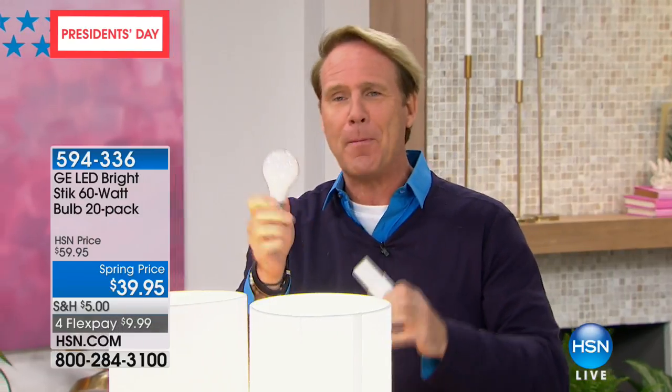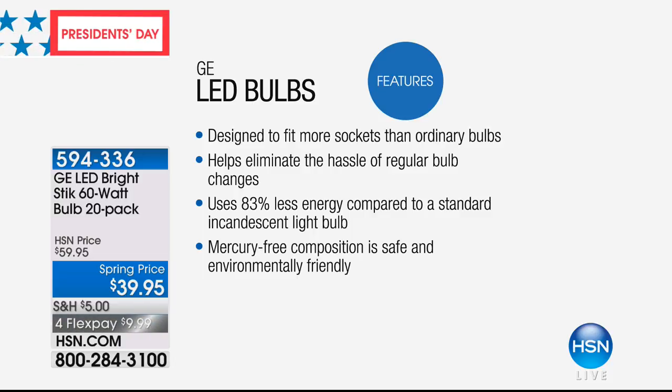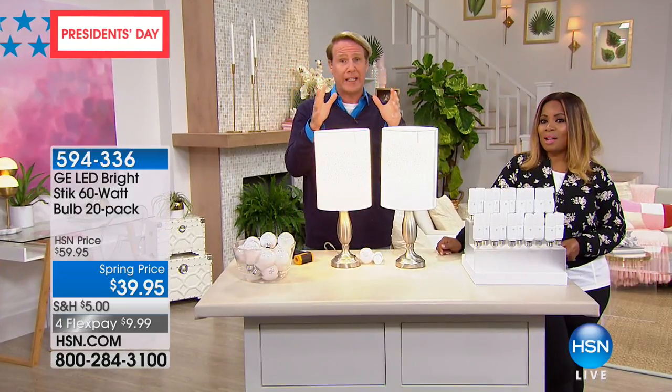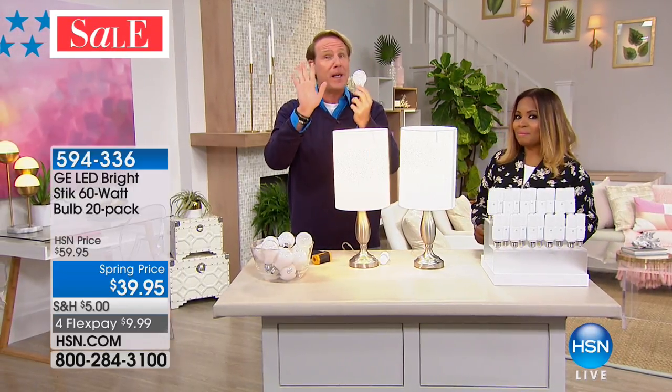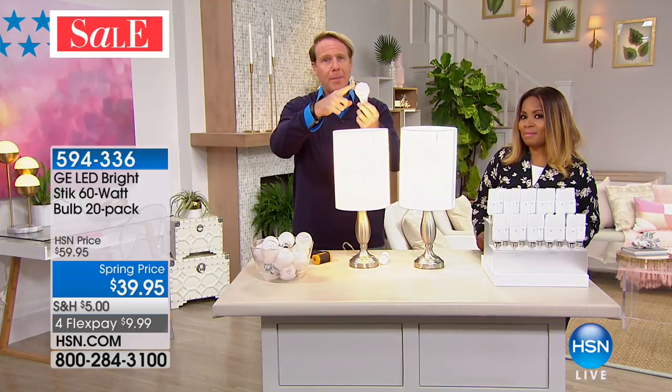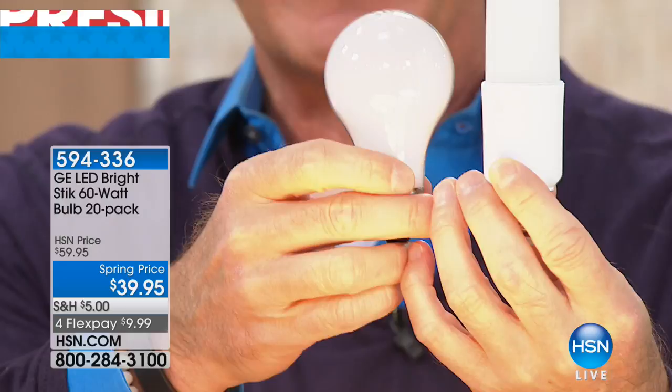The incandescent lasts 11 months and burns hot at 350 degrees Fahrenheit. The LED will never be more than room temperature and will last 13 years. The LED is 83% more efficient. Imagine that over the next 13 years. If your lighting cost is about $500 a year, it's now going to be about $75. These light bulbs are so inefficient they're being phased out by the government — you will not be able to buy an incandescent light bulb in the United States in the next five years.